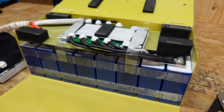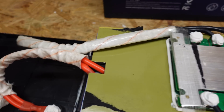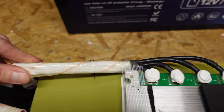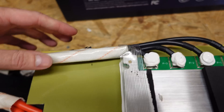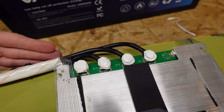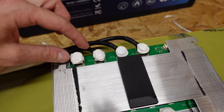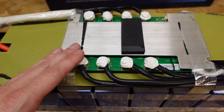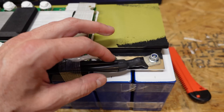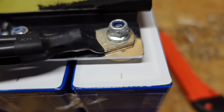There's our battery — this is built very cleanly. We do have four leads here, so this one must actually contain four conductors instead of two. The positive definitely contains two. Nicely routed up to the four posts on the BMS, each one covered in silicone adhesive — same with the battery side of the BMS. The four conductors come out going down to a crimped lug affixed with a locking nut.